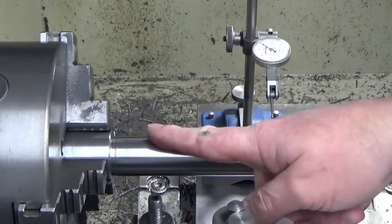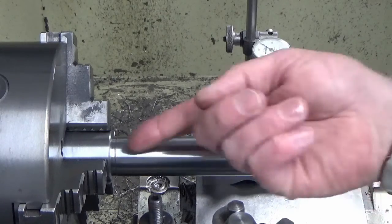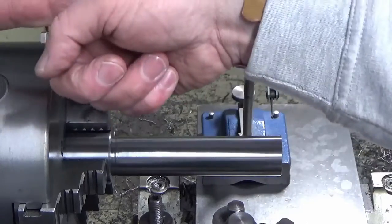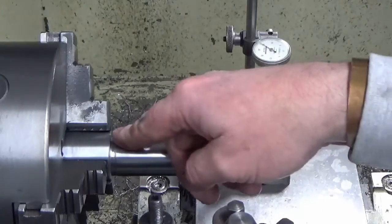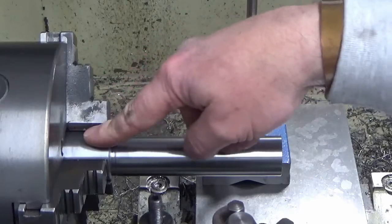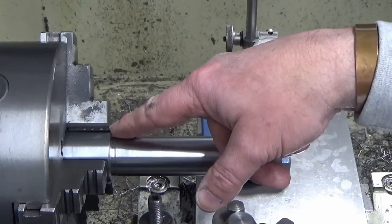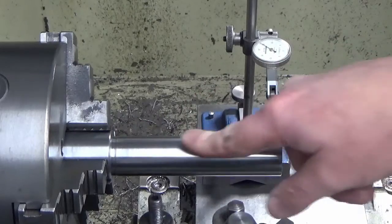Happy days. So we've got our shaft back in the lathe now, and we need to finish this end to length back to this face that we know we controlled from the other end of the shaft, which is down in the headstock. And what I'm using, and I use this a lot on a 3-jaw chuck when I want to not mark up, is this main bearing diameter that's in the chuck, and I use bits of shim. So this is 0.1 of a mil thick shim stock, and in a 3-jaw chuck, very useful.